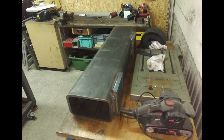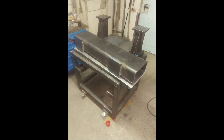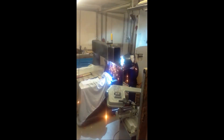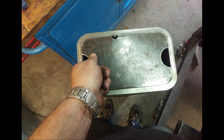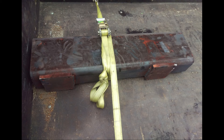Next to come was the gantry itself. It was made of steel pipe too — 250x150mm and 12mm thick. Some plasma cut-off sheet stabilized the beam. The beam was heat treated too, but this time I brought it to a company in Bochum to get it done. It wasn't that expensive — I only spent 60€.